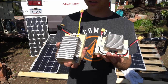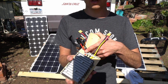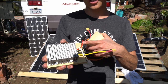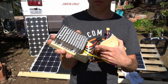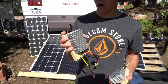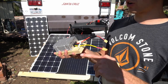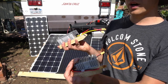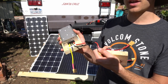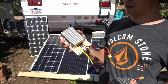These are dead simple: you have an input where 24 or 48 volts goes in from the solar panels, and then you have an output. All you have to do is make sure that the open circuit voltage of your solar panel array is less than the rated input voltage on this converter. I'll have some links in the description for ones I recommend. This one is rated at 30 amps output; another is rated at 20 amps output.